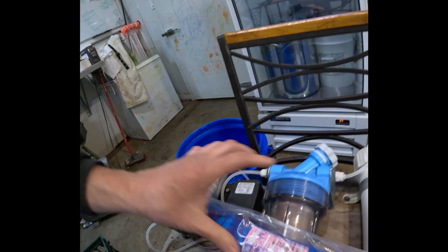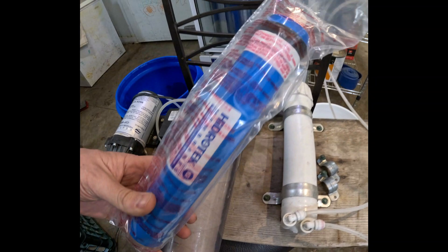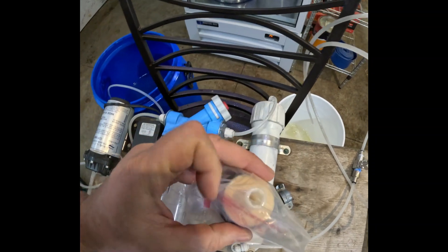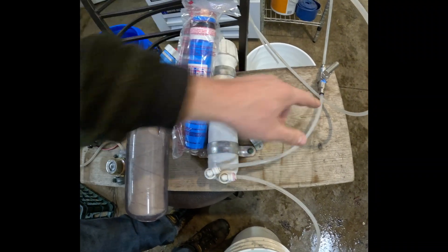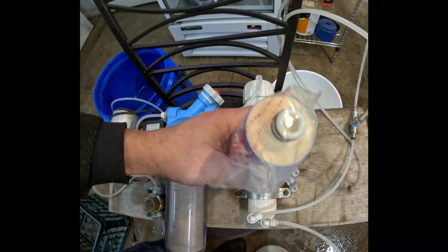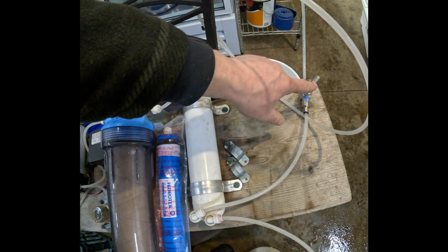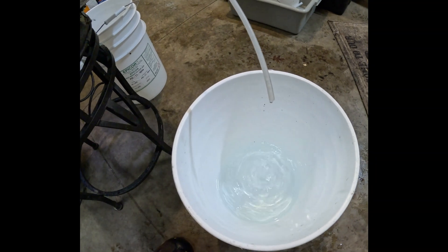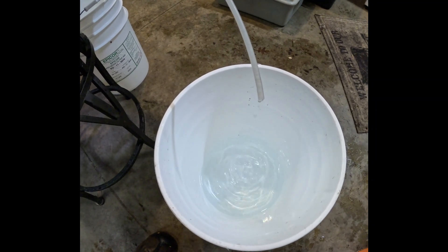I have a brand new one here — this particular one is 100 gallons per day. Basically water is coming in through the top tube and it can easily go through that bottom tube. By throttling the back, it's kind of like a toilet paper roll — by creating pressure here you're forcing that water to come back through and come out the clean end. We've got hydrometers that will show you the percent concentration of each, and we'll run through that here in a second.